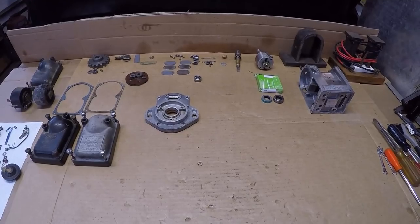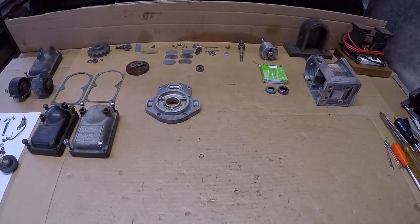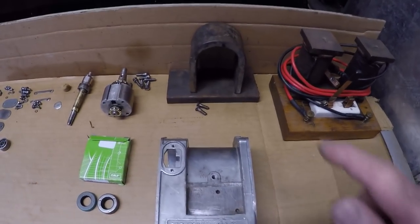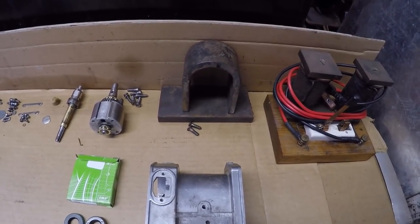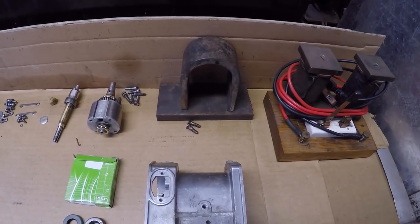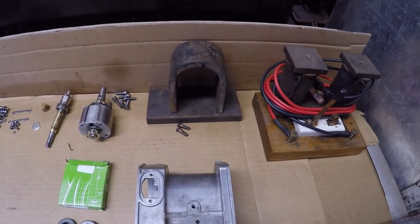Here we have the mag all cleaned up and ready for assembly, laid out at the bench. Let's run through a few of the things I did to get to this process. I got all the magnets cleaned up. I do have myself a small magnet charger — we'll probably throw in a little extra charge in that magnet. It did spark good, but we will give her another shot or two to get that back up to snuff. It's not quite as big as the commercial ones some of the guys use, but for my needs it has been working.